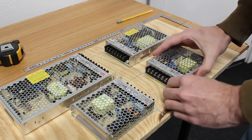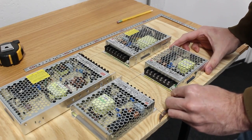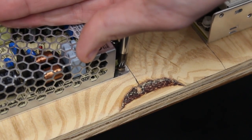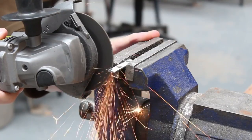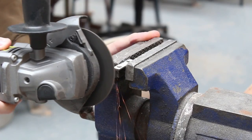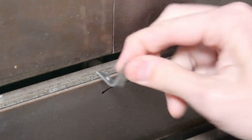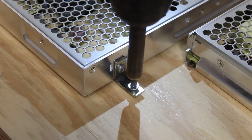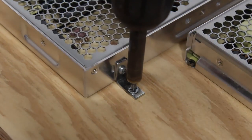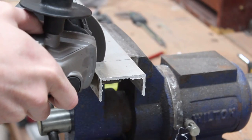That'll let me mock up the power supply board we just cut to check clearances between the power supplies and the back of the card cage. We'll place the power supplies where we want them and screw them down, but the 5-volt supply didn't come with screw holes or the proper brackets, so I had to make some. I quickly chopped an L bracket in two, then went over to the metal brake to give it a 90-degree bend — those are going to work perfectly.